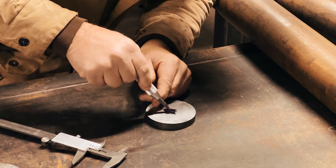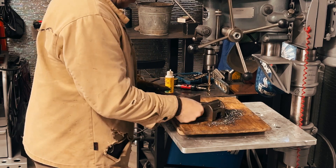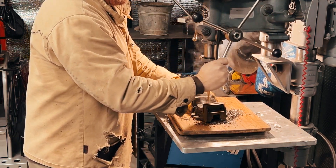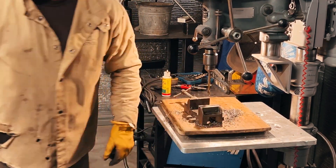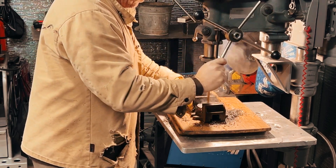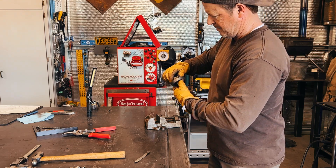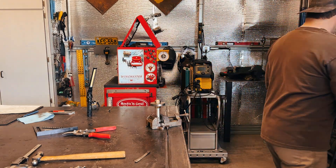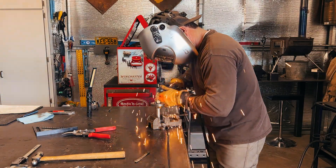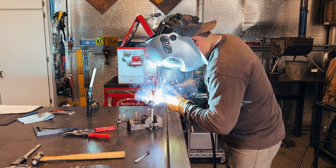Take a hole punch and mark the center - this will help your drill bit stay lined up when you get to your drill press. Put the insert into a drill press vise, which helps keep it stable and flat while drilling those holes in the center using plenty of oil. Now we take a spare bolt, put a nut on it, and sandwich the insert between another nut to help keep it all lined up. This way, when you go to tack weld the nut on the outside, everything is sandwiched nice and flat. Quickly tack welding all the way around and then coming back to weld the nut solid to the insert, as we certainly don't want the nut to break loose while using the roller.